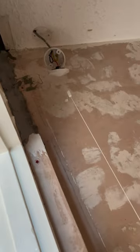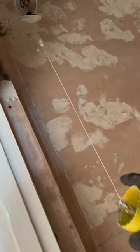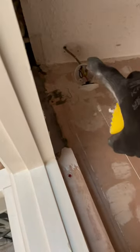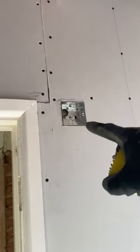I'm fitting a fast fix circular box up there. I tend to do that anyway because it allows you to have a little play in the box behind — same as when I'm fitting a CO. I'll fit a 64mm circular fast fix box so I can hide all the slack up in there. I'll drop the feed into there, drop the switch wire out and down to here, which I've already started pulling in, then daisy chain off to the second downlight. I'll take a three-core from this position and come around into the fan isolator. I'm not teaching you how to do it — just showing you what I'm doing.